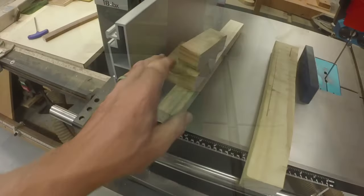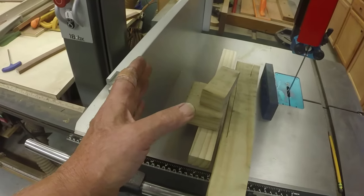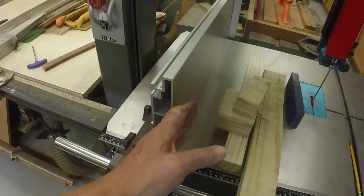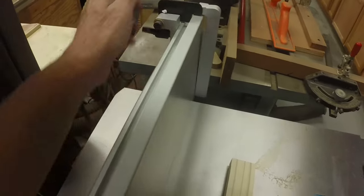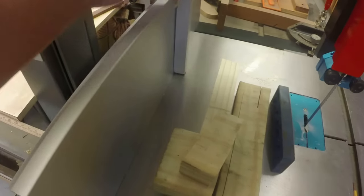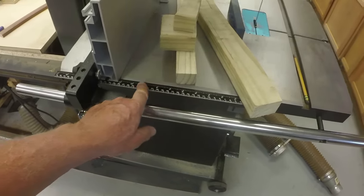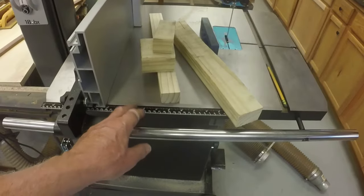I do like the tall fence - it's about six inches tall, which is great if you're re-sawing lumber or cutting boards on edge to make two thin boards out of one thick board. It has a stop down here that you can adjust to a particular length of cut - if you're cutting three inches deep, you set this and it stops your cut each time. There's a scale that you can adjust for repeatable cuts, though every time you change the blade you have to readjust it.